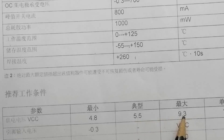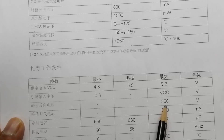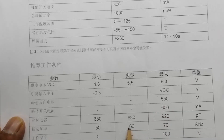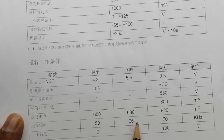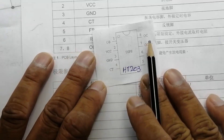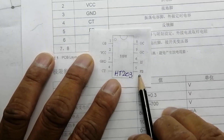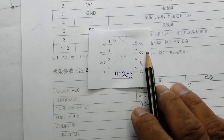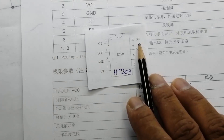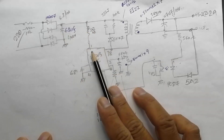When the voltage drops at full load condition we will receive this voltage — normal operating voltage is 5.5 volt. The operating frequency is 66–67 kilohertz. Pin number three is ground, pin number four is timing capacitor, pin number five is feedback, pin number six is current sense, and pin numbers seven and eight are collector outputs.